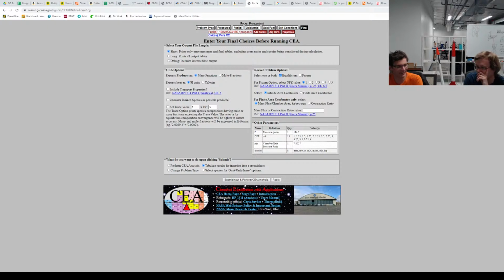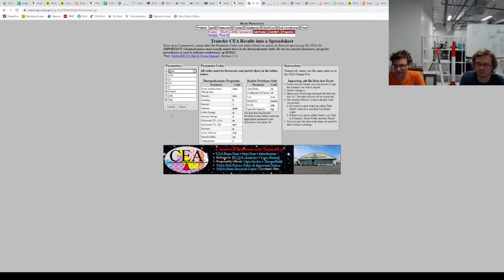But thinking about it, I asked some people, and they said that if you had this pressure propagation wave upstream, your check valve isn't really going to close fast enough, especially if it's not a flashback arrestor. It's like a ball check valve, and that ball's momentum is going to take time to seat, and the propagation of that wave is already going to make it past the valve, possibly past the ball valve, and continue to wreak havoc on the rest of your components. So we're debating just taking it out because it's less money, less components. We're all for it. It definitely simplifies the plumbing and saves money. So yes, I think we're going to scrap those.